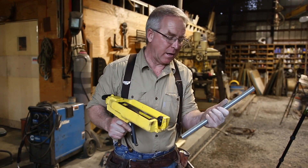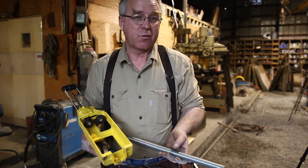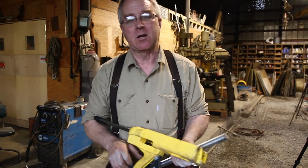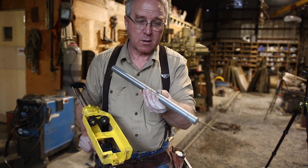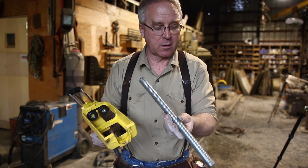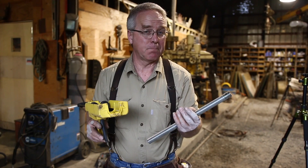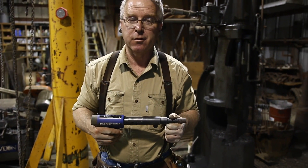The attachment method of steel threads into concrete that has the highest resistance to draw-out is to epoxy a threaded rod into concrete. You try not to overfill the hole with epoxy or you squish expensive material out onto the slab. The key thing is that you get the inside of the hole clean — you need to drill it, brush it, and inject some air. You get it just as clean as you can so that it gets a good mechanical bond, as well as a chemical bond, between the epoxy sleeve that's formed, the threaded rod, and the inside of the hole. An engineer will often specify this because he can establish a quantity for the resistance to draw-out that he cannot depend on with just a wedge anchor or other mechanical connection.